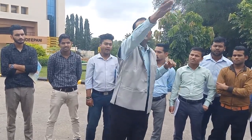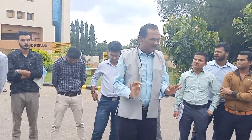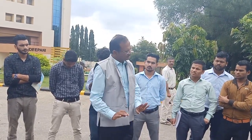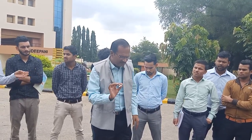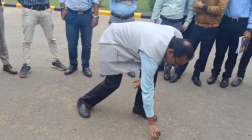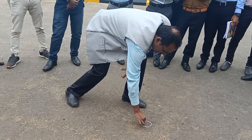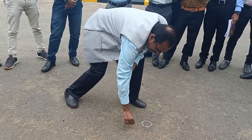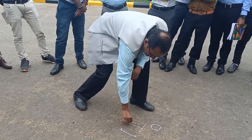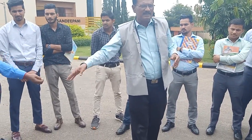Our starting state is here — we have to start the survey of this project. Select the first permanent point. This is a permanent point, not a loose stone. The road is permanent. You can mark it with paint, a nail, or chalk. Put a small 2mm circle and then encircle it, and name this point T1.